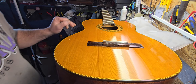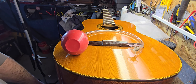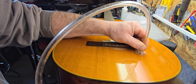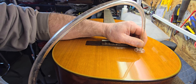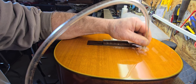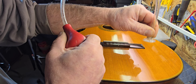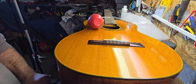So what we're going to do here — I'm going to get out my glue pump. This is my little thing I use to patch cracks with. You'll see a lot of guys take a suction cup and push the glue down through, which does work. I find this works better for me though, because I can hold it on the crack and put constant pressure and really drive it through there. When I get ready to pick it up off the guitar, it's not going to pull the glue back out like a suction cup will — when you pull that up, it's going to pull some of it with it. If I hold constant pressure on the ball, I can pick it up without taking glue with it. This is just my method — there's a lot of different ways you can do this.